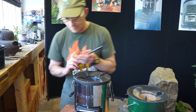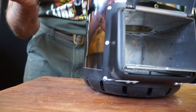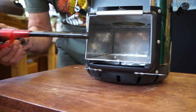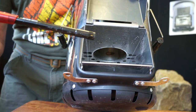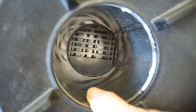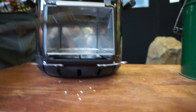The SilverFire Survivor also has a door, and this door retains more heat in the firebox and combustion chamber, resulting in cleaner emissions and a hotter fire because you're retaining more heat in the stove. That allows greater mixing and a much hotter flame. You can also see at the base of the chimney, inside at the back, are secondary air holes. This is the first rocket stove that has both primary air under the grate as well as secondary air above the flame. Just like pellet stoves that aren't certifiable for homes due to primary natural draft air, by adding secondary air we do clean up emissions.